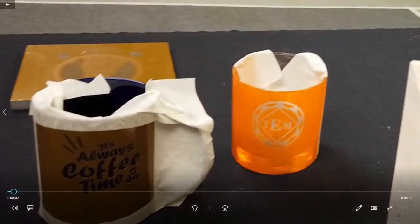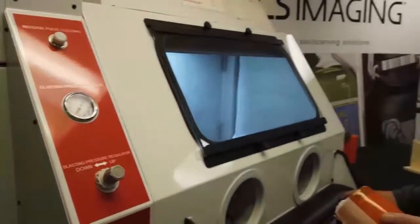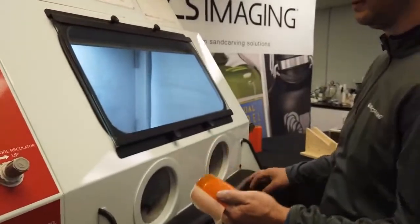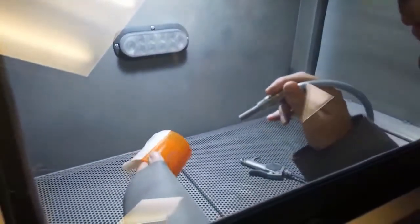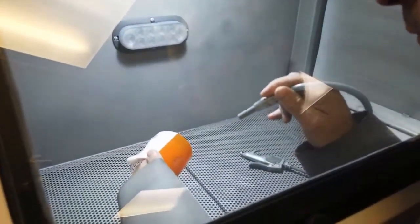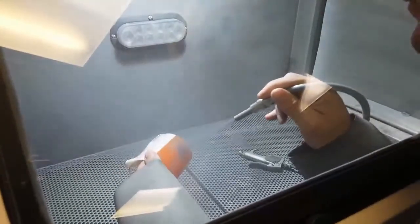All right, so I'm Dr. Fine Grit. That's the grit I use for all of my projects, and we're going to do a little video, like Dave mentioned, on the next part of the process, which I feel is the best. It's the sand carving, and that's the fireworks. It's the best effect. So here's what we're going to do: we're using our Crystal Blast Elite machine with 180 silicon carbide in the machine.